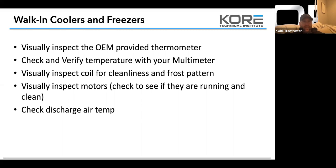So as you guys are checking, again, we're on the evaporators. We're just checking, we're there at the case, we're checking the air temps. And then now we're checking the conditions of the evaporators. Like, is it clean? Are the motors running? We deal with a lot of multi-speed motors that we can actually plug in a tool to the back of them on a lot of these Heatcraft cases and Hill Phoenix cases and actually adjust the RPMs of the motors. So that's become an issue.